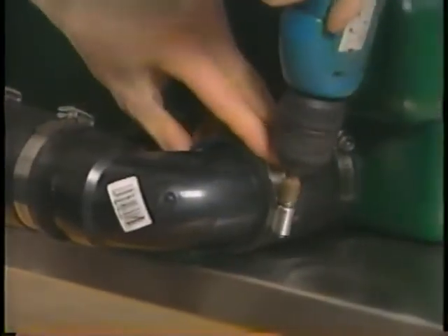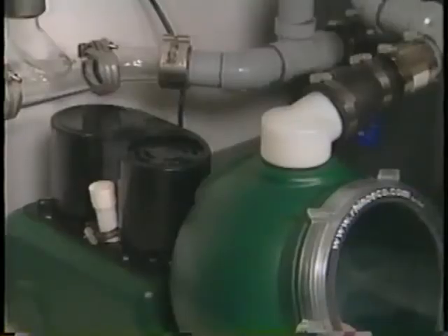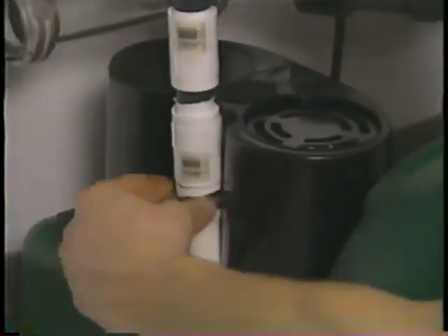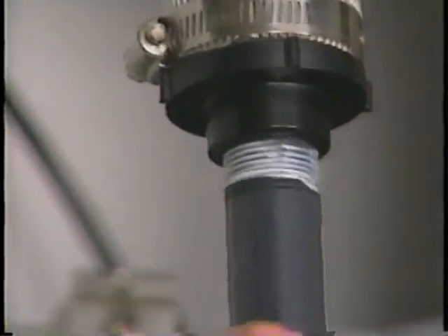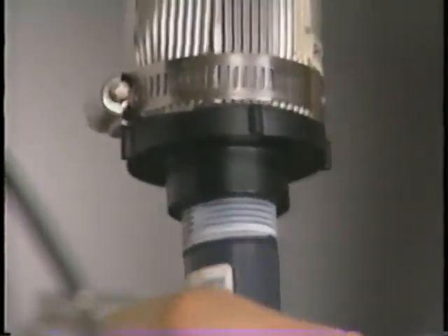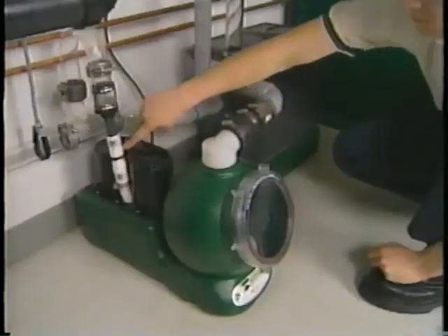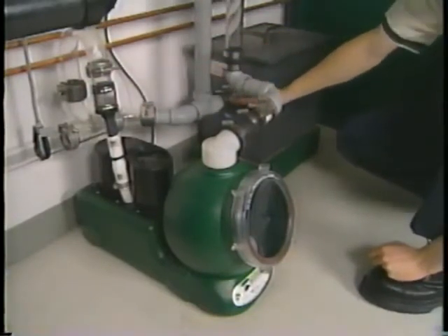Always make sure that all fittings are securely fastened. On top of the pump, you'll see a pump outlet pointing straight up. You'll need a one-inch threaded plastic nipple. The end of the nipple is inserted into the pump outlet and secured with a one-inch hose clamp. The threaded end of the nipple is screwed into a one-inch to one-and-a-half-inch female-to-male adapter, threaded to glued. Wrap with Teflon tape. One-and-a-half-inch piping or larger, as required by site conditions, can then be extended to the building drain.